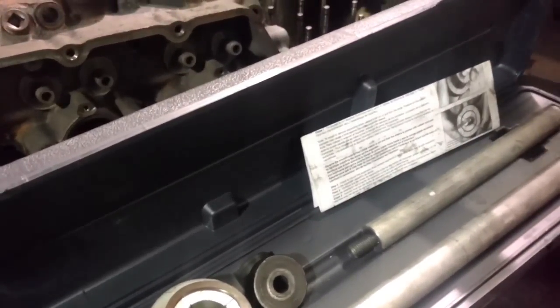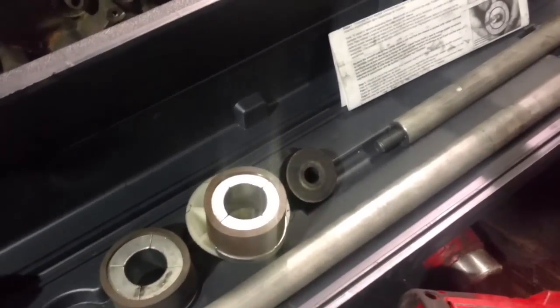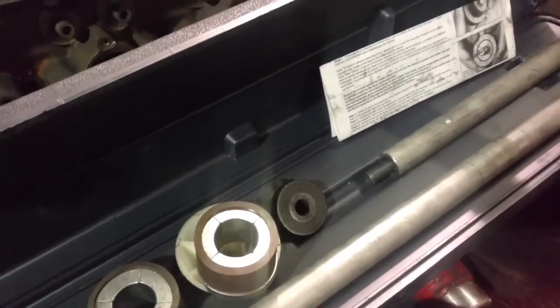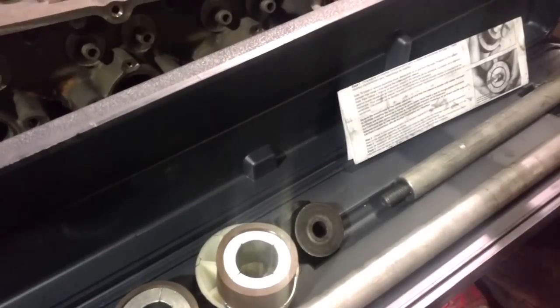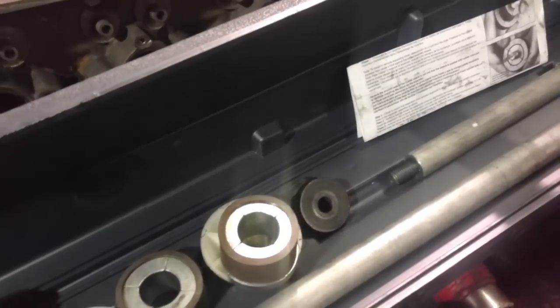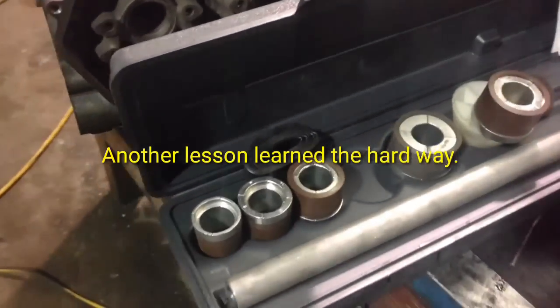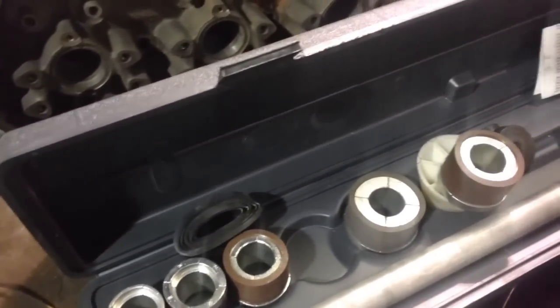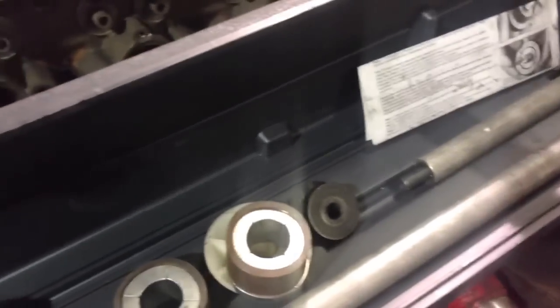I had an engine I'd sent to a machine shop out of a 3126 CAT motor. I didn't have this tool, and the machine shop put the cam bearings in. I didn't check them. When I rebuilt the engine and put it all back together, it starved the rockers. There are two holes in a 3126 CAT motor — one feeds the cam bearing and one feeds the rockers and everything on the top end. We fired it up and it ran good, but lasted about five hours, and I had to buy about $6,000 worth of rockers and a cam. They had the oil holes 180 degrees out — the feed hole from the oil gallery wasn't lined up.